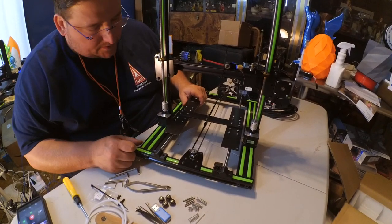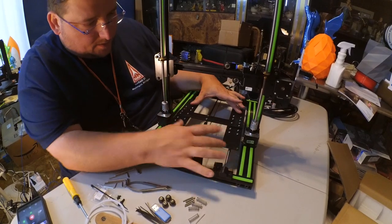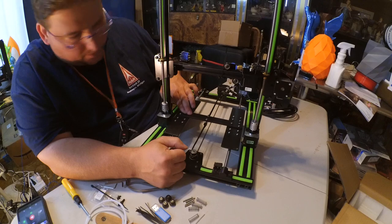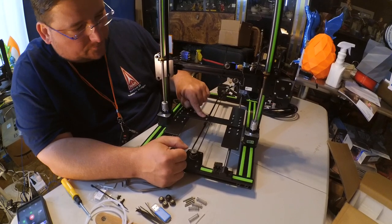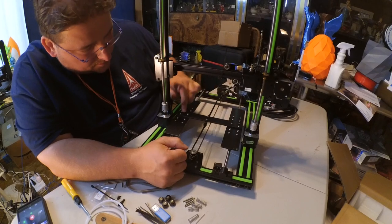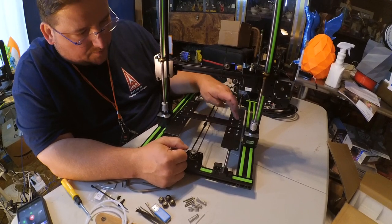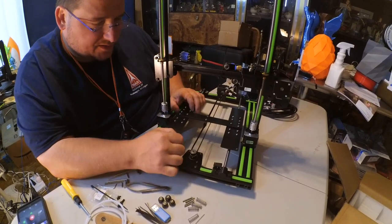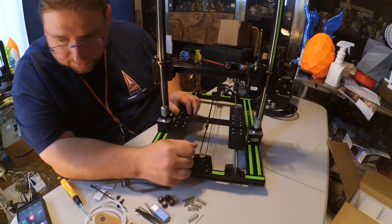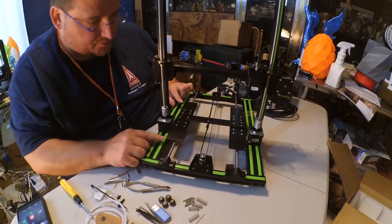Alrighty, here you can see inside here, this is what I was talking about. This is your H plate. It is actually one thin plate going across the middle, 2 nuts holding the ends of the belt. Right. 3 screws go into these H plates. Each of them has 4 screws going into your bearing blocks underneath. Now, on my particular printer, this must have gotten squished at the factory because the box was perfect, so it wasn't damaged in shipping.